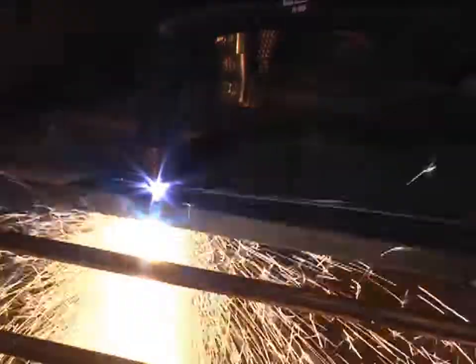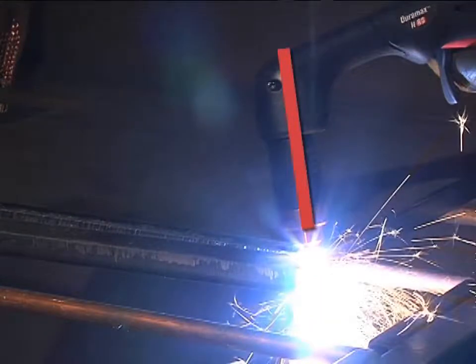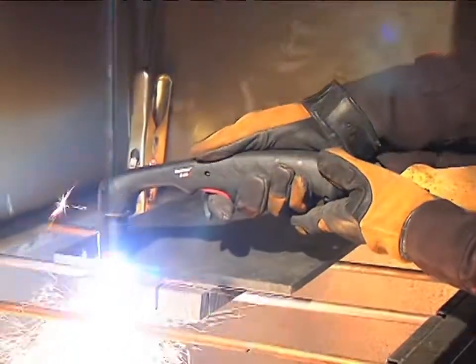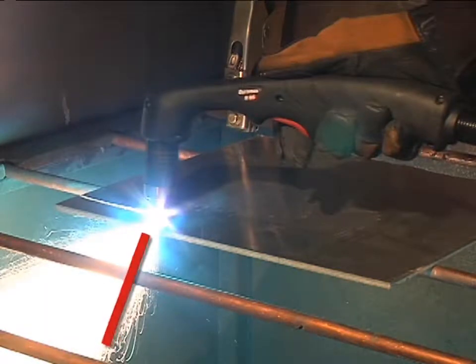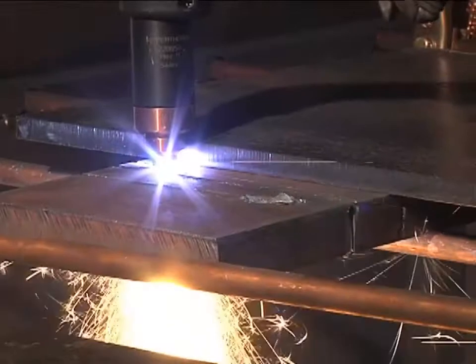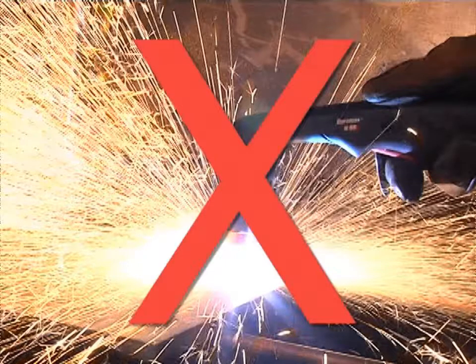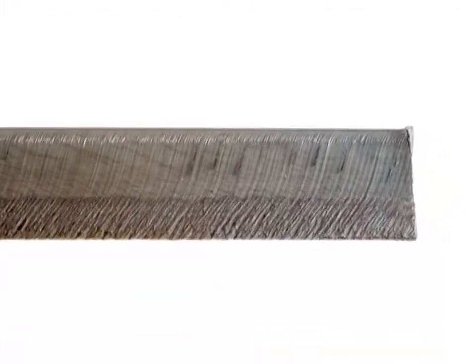The shield may be dragged on the workpiece for ease of cutting. When nearing the end of a cut, angle the torch into the direction of the cut, allowing the arc to come out first to ensure a complete cut. Maintaining proper travel speed is key to successful cutting. Watch the arc beneath the plate, as sparks should lag 15 to 30 degrees behind the cut. If the sparks are vertical, then the speed is too slow. If the sparks are perpendicular to the cut or are spraying up from the workpiece, then the speed is too fast, or the system does not have sufficient power. Lag lines on the finished cut edge should also be about 15 to 30 degrees.